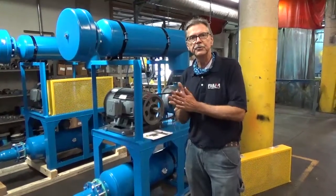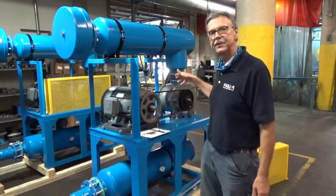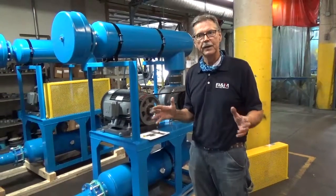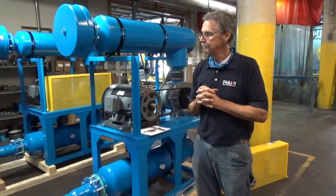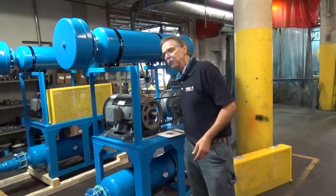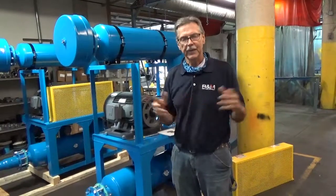After that, the blower is ready for continuous duty and you can run it around the clock. The first week you should look at it once a day — check for leaks, anything running hot, any hot spots, any vibrations, any problems. After that, your checks can become less often. If you follow these proper procedures and steps — all of them inside the manual — you won't have any problems. These blowers will last you many, many years of carefree service. Thanks for watching this video.